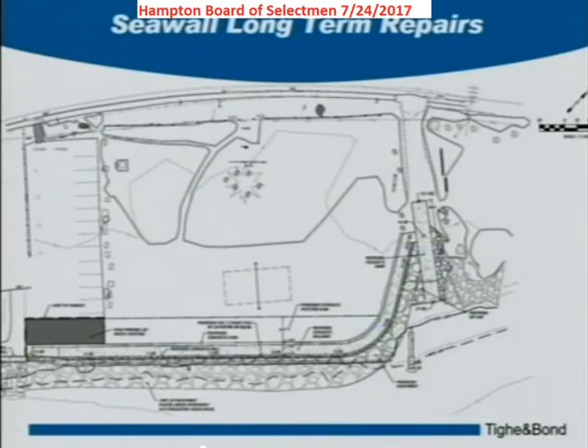In plan view, we are incorporating a curve on the eastern end. Down there, where the beach access ramp is, there tends to be trapped seaweed — and as it rots it gets stinky. We're looking to incorporate a curved corner to help allow that seaweed to pass and continue washing down the shoreline. We think the aesthetic of the curve will also be nicer for park users. On the other end, since we are two feet higher, we will have to incorporate a ramp down to provide access to the parking lot and bring the walkway back down to the elevation of the state walkway. We have spoken with DRED and they've indicated no plans for near-term upgrades, so we'll have to meet the elevation they're at right now.